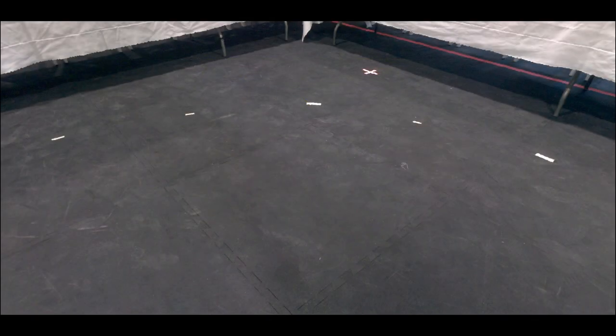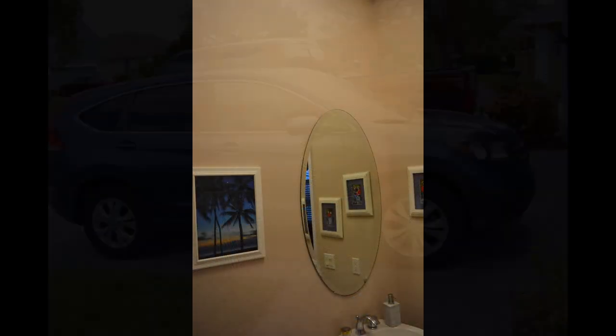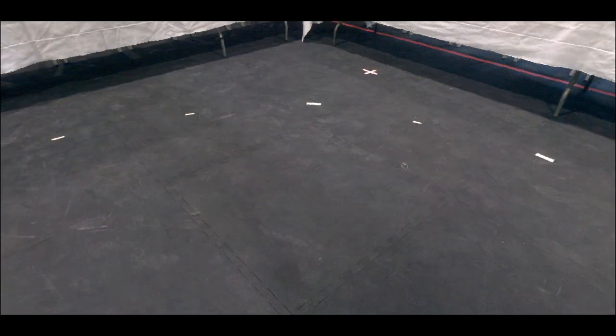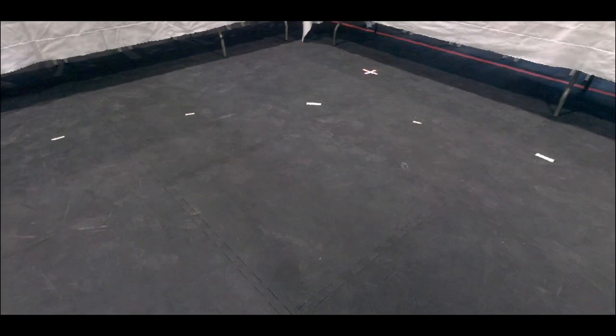The first is a dark matte surface. In the case of dark matte or black matte surfaces like coal or this rubber flooring, the reflectability is very low. This means that laser energy or light is mostly absorbed, which makes it hard for a scanner to, quote, see it. If you scan this type of surface, the resulting scan may look something like this.